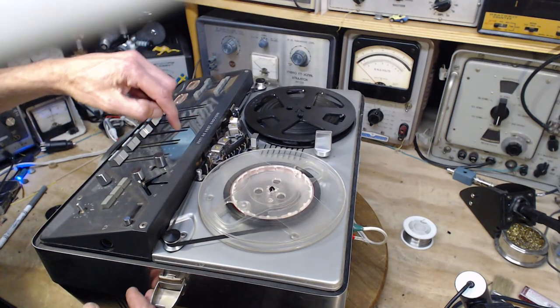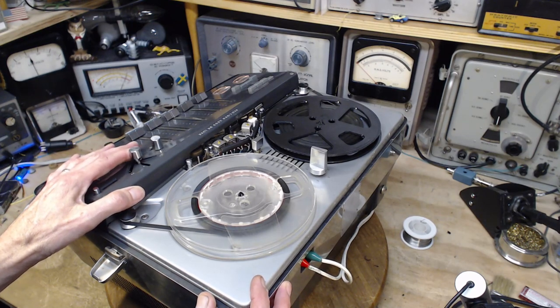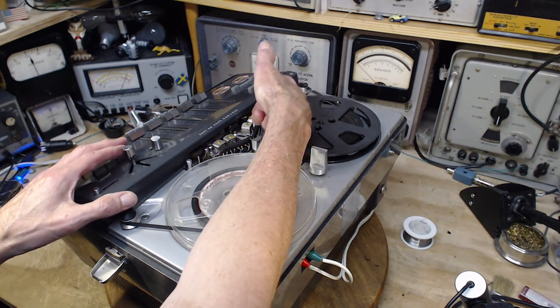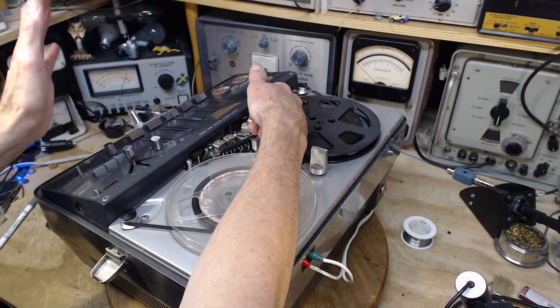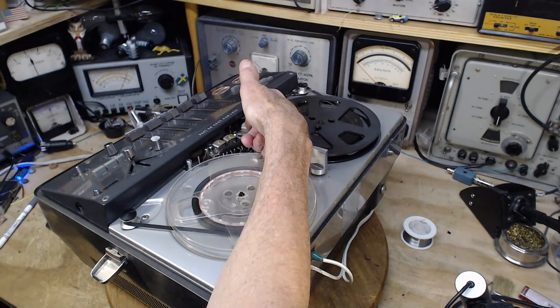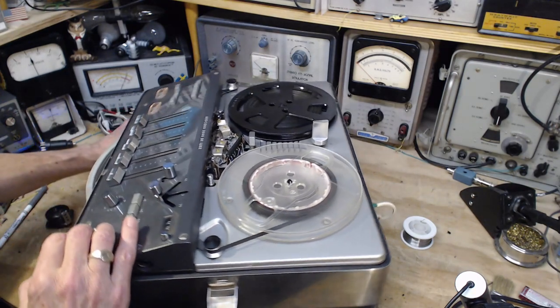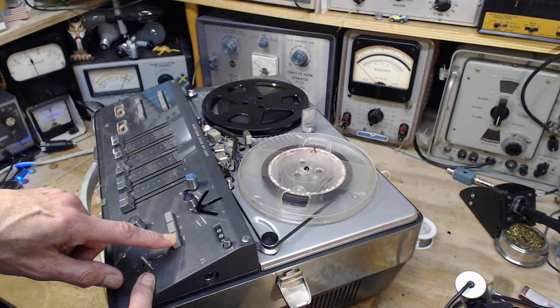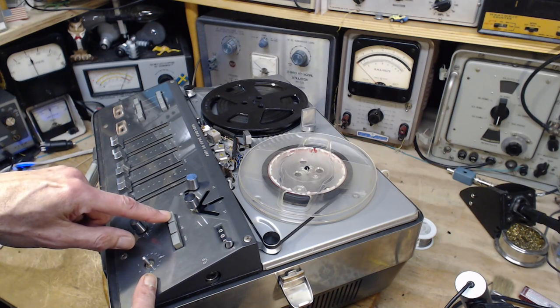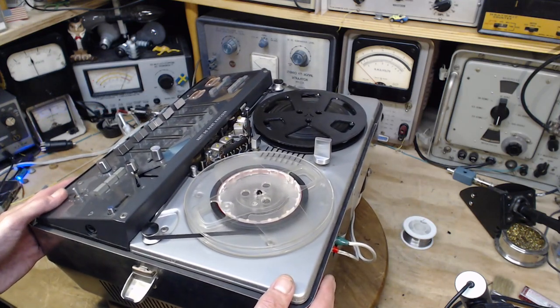Capstan, and a rubber wheel that's going to come forward probably when you're pushing this. Yeah, this little mechanism's moving forward. Looks like there's probably an erase head here that's going to put like a 100,000 hertz tone onto the tape to essentially erase it and get it into a nice state. This is the record head. We have two playback heads here. This thing will do an echo somewhere on here. I saw something. Here it is. There's a button here that says echo. And these two buttons: one speaker, two speakers. Mono, stereo. I don't know what they mean by that.